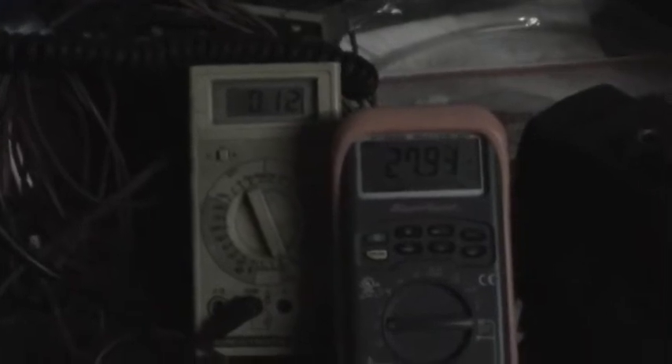Internal resistance is now way too high to draw enough current to put a charge on these, so these batteries are basically destroyed from the earlier problem in the UPS. Even though I have everything simulated here, I really wasn't able to recreate the conditions I saw this past weekend when the UPS was running really hot and gassing excessively. It's kind of amazing that the temperature from the heat gun didn't really have hardly any effect at all.